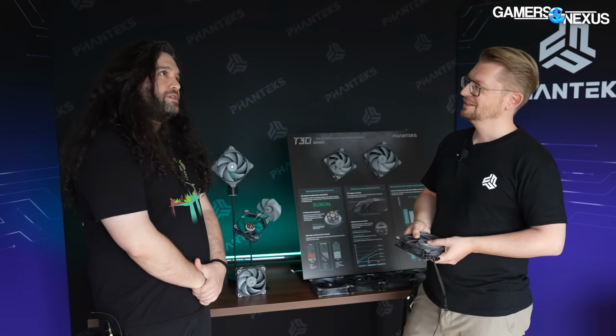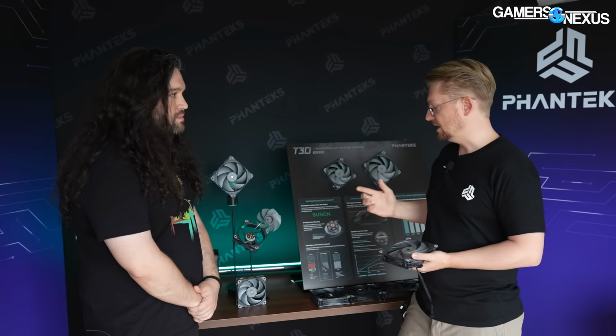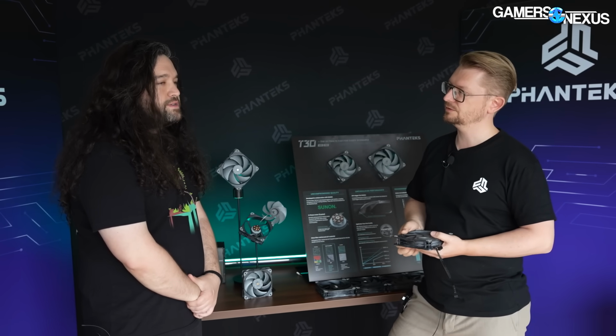So tooling for cases, I know, can be hundreds of thousands of dollars. Yeah, these are very expensive. In general, injection molding tooling is a lot more expensive because there's a lot of cooling involved, for example, so it's way more complex. And if you go glass fiber filled and then LCP, it's way more expensive.